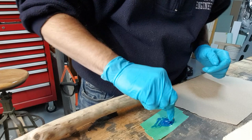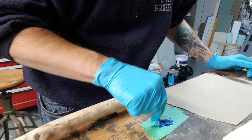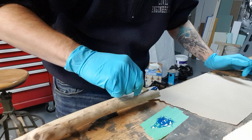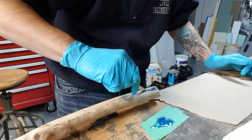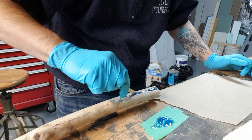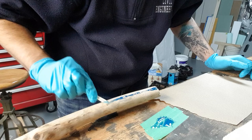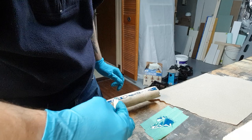What I have here is a very thin piece — I think it's bamboo — that I keep especially for filling in cracks because it's super thin. What it allows you to do is get into the crack and pull the epoxy into it, reaching down inside. Sometimes these five-minute epoxies are a little bit thicker than a slower drying epoxy which flows like water. So you just sort of drag it into the crack. In the more narrow sections where it doesn't fit, you just put it on top and work it in — it does get messy.